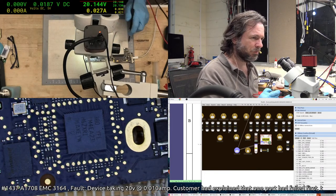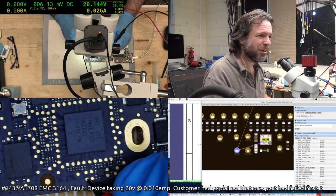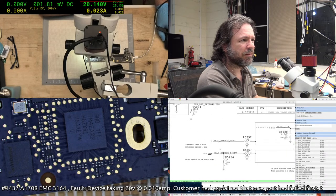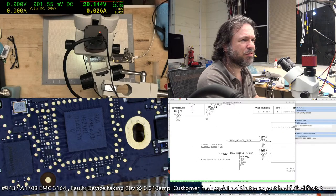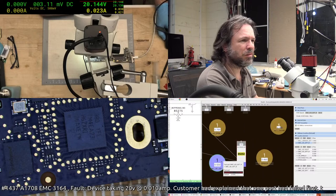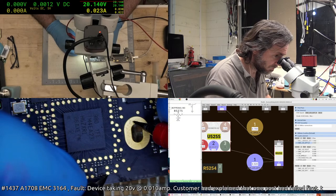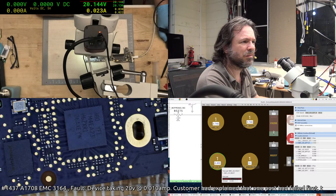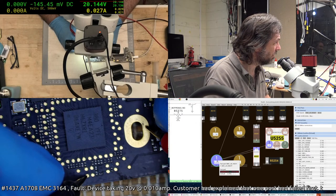That's some weird floaty voltage, that one. We've definitely got power. 6.2. Yeah, you'd expect that to be pretty much zero, not that weirdness. So we want them to be high. 52, 52. Where's the right one? Okay, yeah, so that's high. And that's just weird.